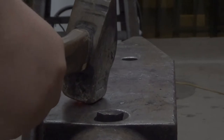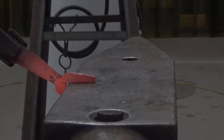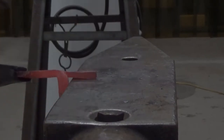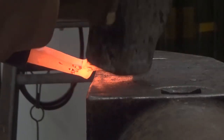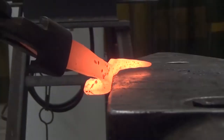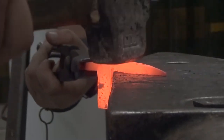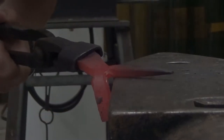From this point it is largely going to be the same as just drawing out points like we were doing for the S hooks and the J hooks. You're going to hang it over and make sure that, just like with a leaf, the tine that you're not working on is hanging off the anvil so that there's no risk of you accidentally hitting it. You're going to draw this out until it's a square point, and then I decided I was going to round mine out — you don't necessarily have to. I think it will look a little bit nicer; if you leave it square it will be very apparent if it's twisted by accident. I can't hammer it straight on and off otherwise the other tine will get in the way. I didn't actually measure how long this first one was — I just planned on making the second one to match, and this happened to be almost exactly two and a half inches long.